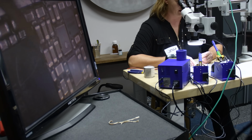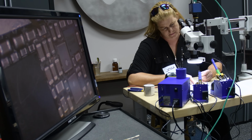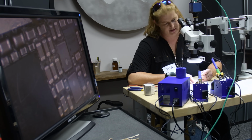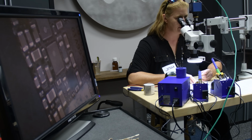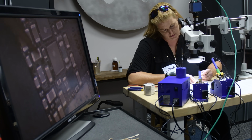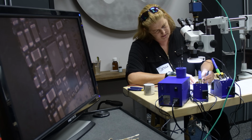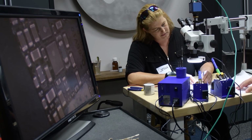So what we had missing then were 1, 2, which are on PP GPU, and then we are missing these two and these two. So here, these two, A and B. If we look up and say, what are those rails? It says here, one of them is called PP GPU. And the other one, I can't tell. It has a 1 with a 0.